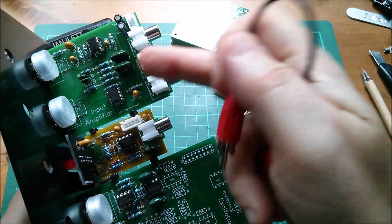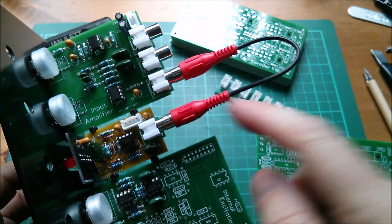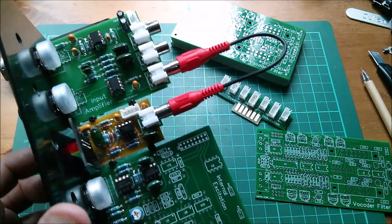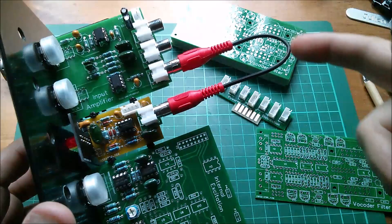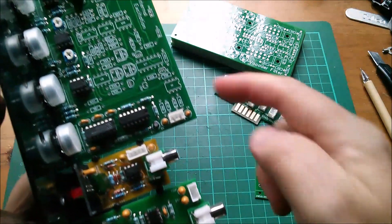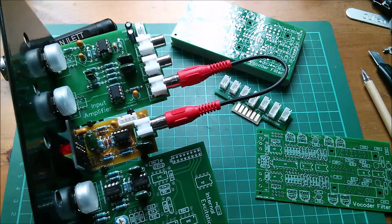For internal audio interconnects I'm using phono-to-phono connectors. Here's one, for example: it comes out of the microphone pre-amplifier board, goes into a little phono-to-phono connector, connects onto the LED bar graph board, and gives a lovely little internal connection that can be taken off if I want to feed another signal into the bar graph board. It makes everything very flexible - I can remove and reassign these connectors very quickly. The same signal comes out in parallel on three connectors, feeding different parts of the circuit.